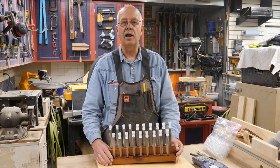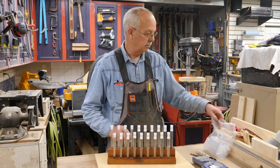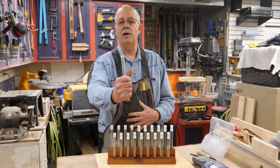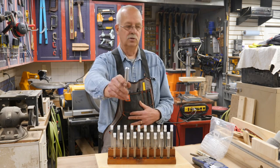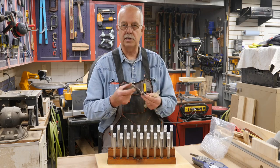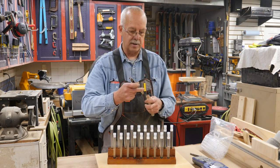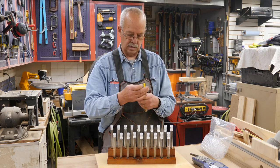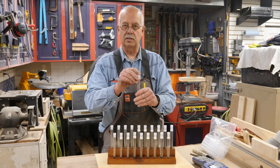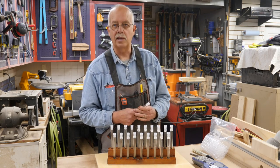After I drilled these, I found out that these tubes are not flat on the bottom — they have a taper, they're rounded. So I took a 5/8 inch twist drill with a 118-degree point and followed through a little bit to make a bevel on the bottom, to get them to sit better. But they were still like weebles — weebles wobble but they don't fall down — and that was the problem: they were wobbling around in there.